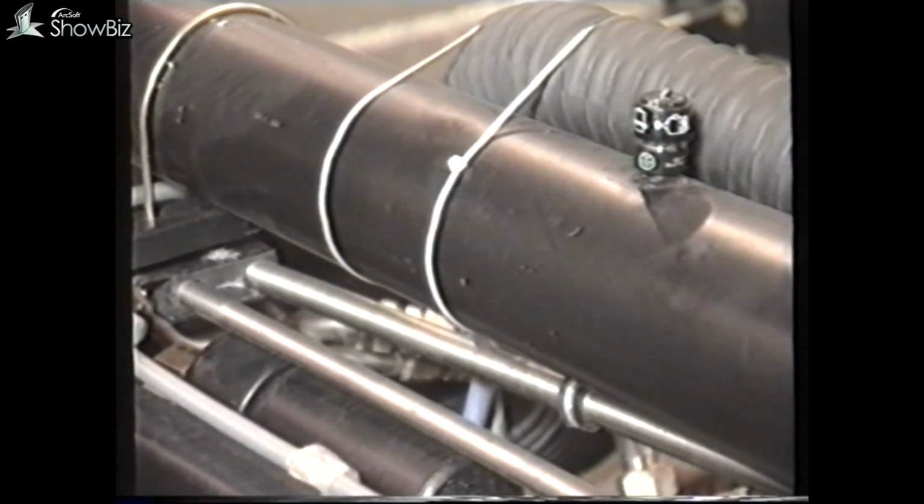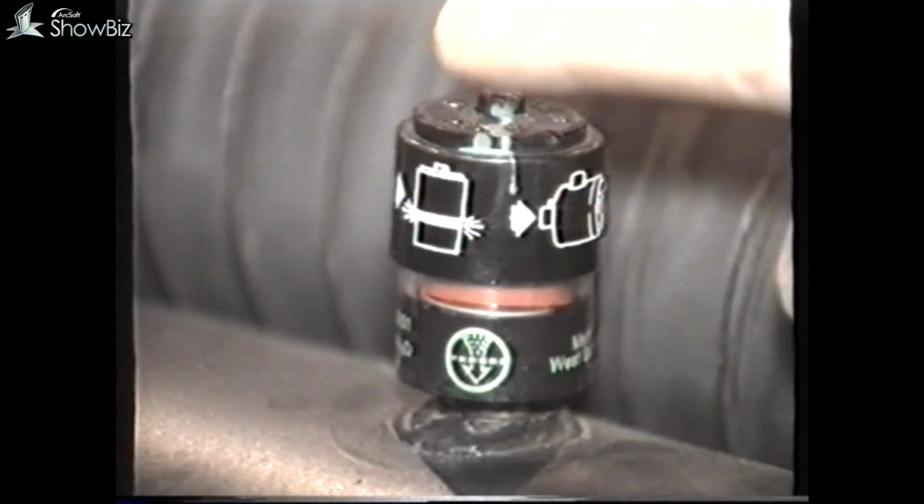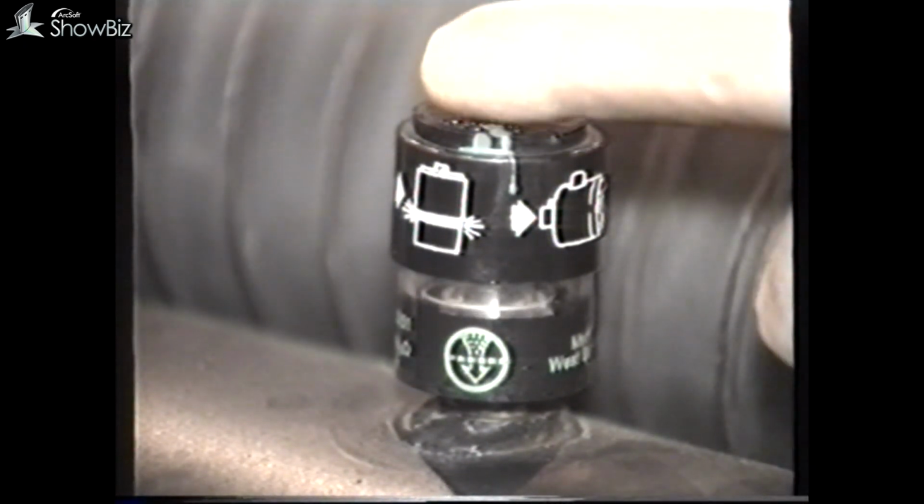The condition of the air cleaner element must be checked by inspecting the pressure drop indicator located on the intake trunking. If the indicator shows red, like this, the air cleaner element must be changed. On completion, reset the indicator by pressing the reset button.